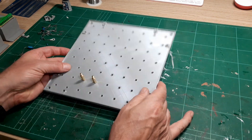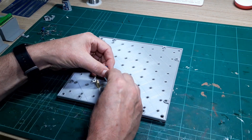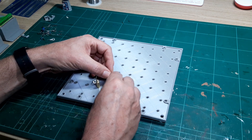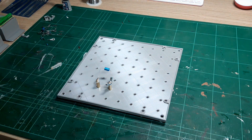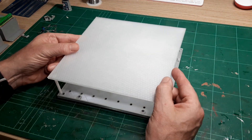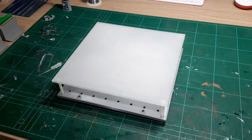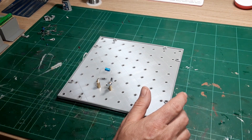The system is pretty much completed — the standoffs are screwed in and ready to take components. It's just a case of using a wing nut to secure them. The wing nuts look a little ugly but they're more convenient for this sort of work. There are potentially very high voltages along this system even using valves, so I built a protective cover to drop on top. It was supposed to be transparent plastic but it never prints transparently, and making one from acetate didn't work well, so the printed version is functional.